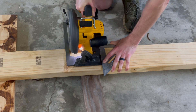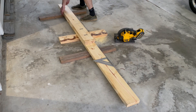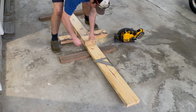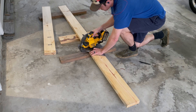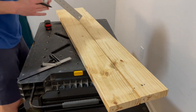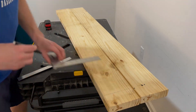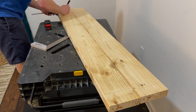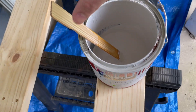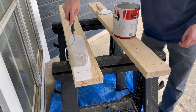Starting with the 2x6, we're going to cut two 52-inch sections to span four studs. You can totally use a 10-foot board for this, but I wanted to use the off-cut for something else. Now transferring each stud location to each board — our studs are 16 on center. After that, we're going to mark screw locations for each stud using three screws per stud per board. Counter-sunk pilot holes were drilled off-camera, and the boards were painted to match the wall color.